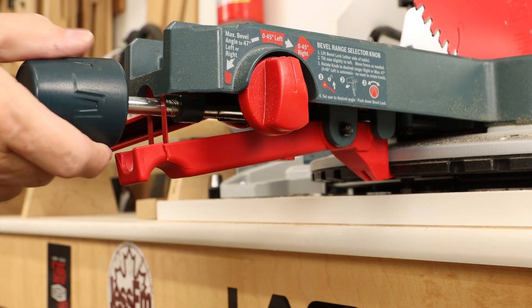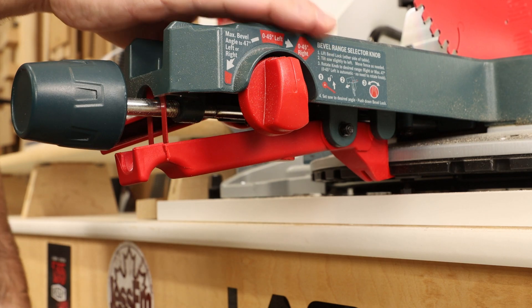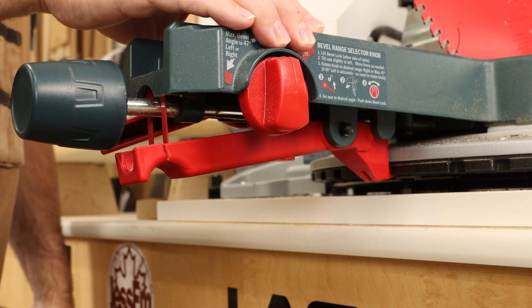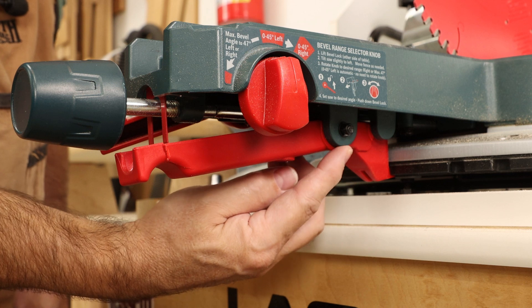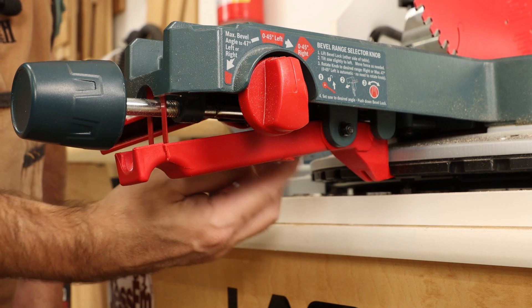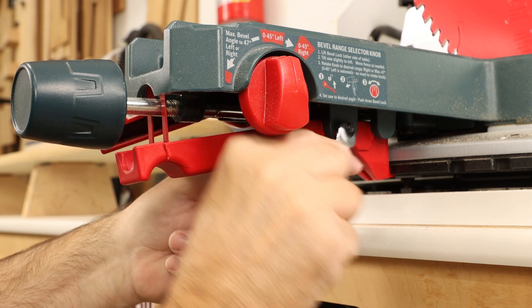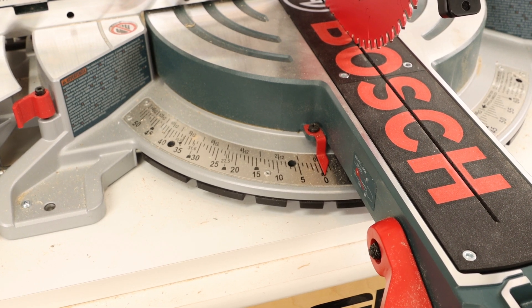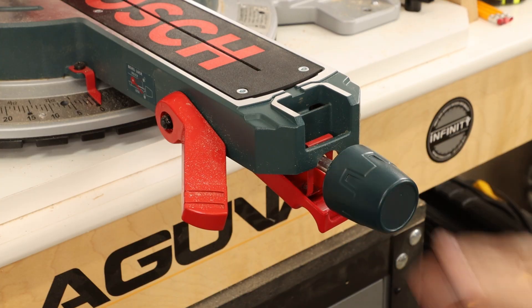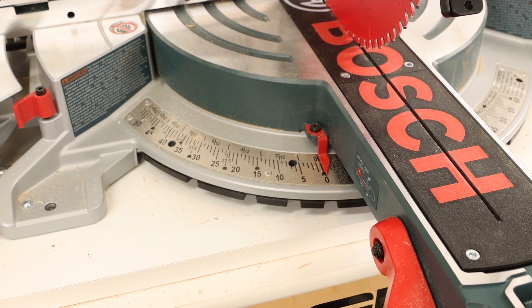With the miter detent issue, with the locking knob loosened there shouldn't be any side-to-side play of the saw. Mine was good right from the factory, but a lot of people have that problem. If you can deflect it side to side with the knob loosened, you want to locate this miter detent lock lever and find this nut here — that's an 8-millimeter nut on one side and a 10-millimeter bolt on the other side — and just snug that up a little bit. That'll prevent any of that side-to-side slop. To demonstrate, I'll loosen this up and show you how much slop you can develop. Straight away I can start to replicate that slop people have complained about — when you tighten the securing knob the slop goes away, but you want to know it's going to exactly find its spot right at zero degrees, so just go ahead and tighten up that securing bolt.